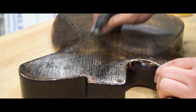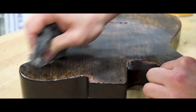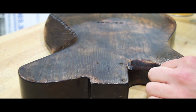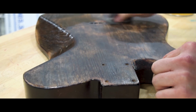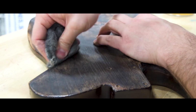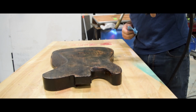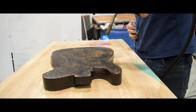The product that I'm using with it is simply paste finishing wax from Minwax. You can also use other waxes. For example, the Blue Label paste wax from Behlen works really well for this. But this paste finishing wax is perfectly adequate, and what it does is I could polish a matte finish up to a satin finish using this method. So it'll take me in that direction, but it'll also take me down from a gloss to a satin finish, which is what I'm doing in this case.